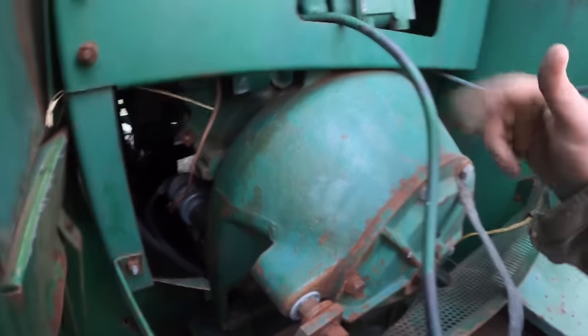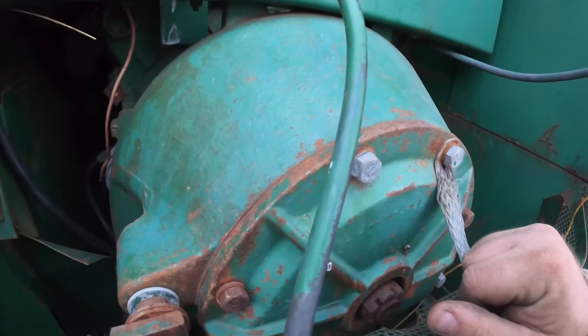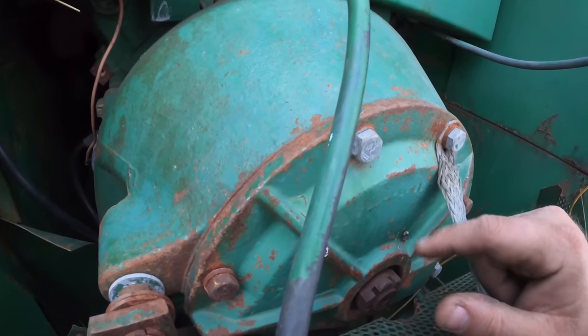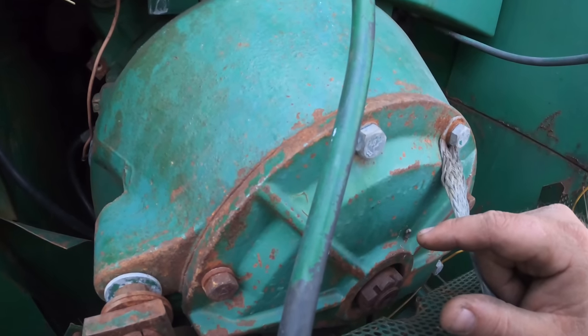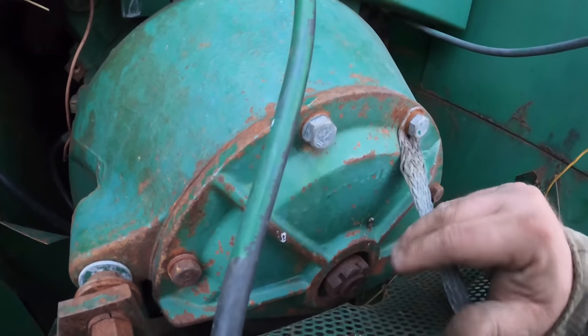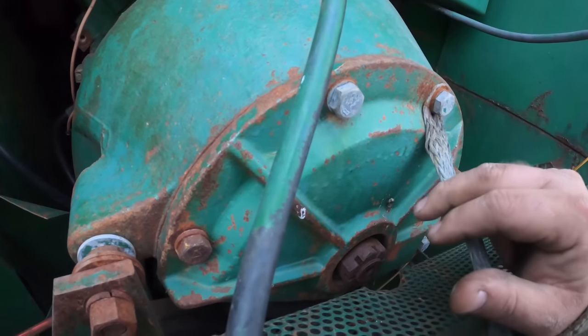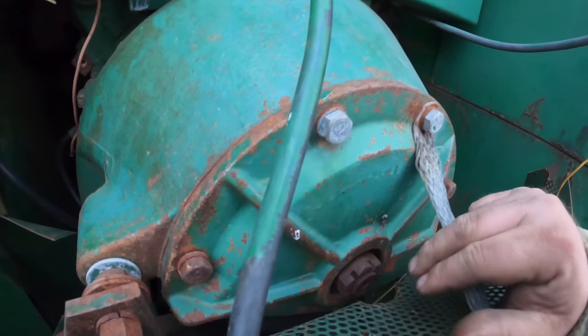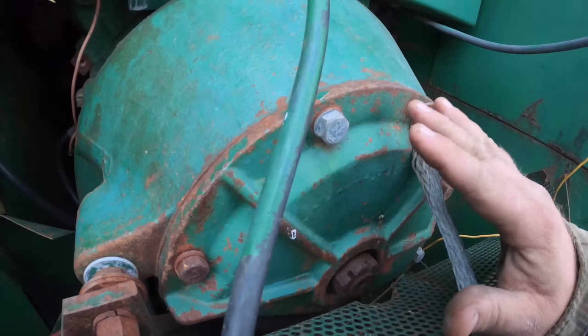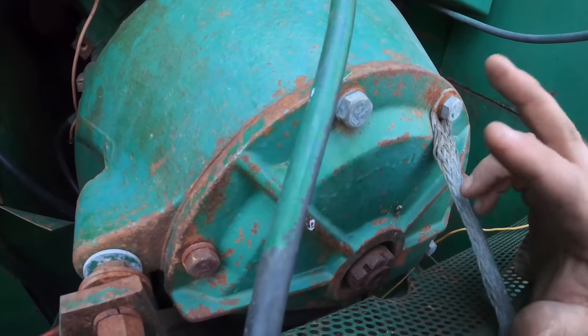And the other shaft setup I have on hand, I bought for my red one, because the one for factory air conditioning is longer. It sticks out past here. There's another pulley that goes on out here, and then to this bolts a bracket where your compressor mounts, and then your air conditioning runs off the backside of the motor.